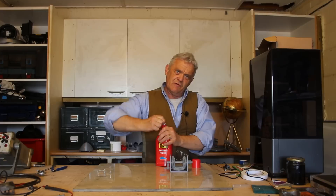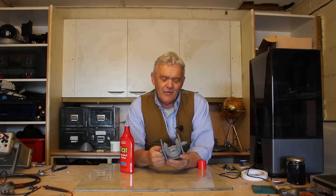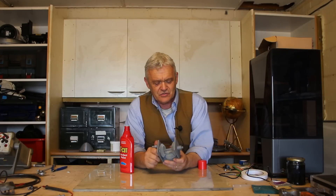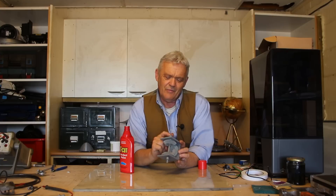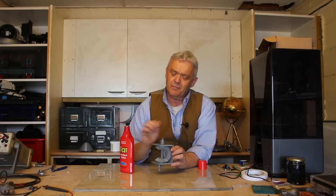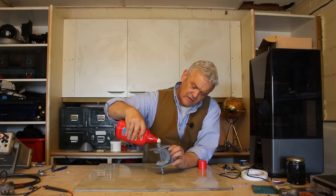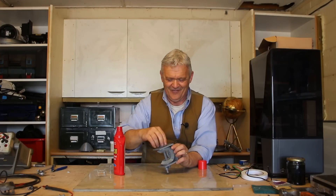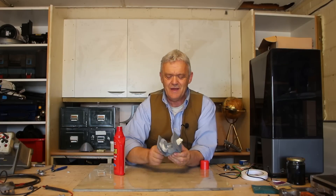Cracks and stressors form when a surface is uneven, and these surfaces are 3D printed, so they're more lumpy than the Himalayas — they are stiff, they catch, they rattle, and they make an awful lot of noise. What Mark said to do was apply some T-cut to the gear teeth and the places where you want them to mesh, so a little bit of T-cut on there and a little bit on the gear teeth, and then give them a spin.